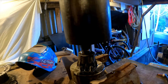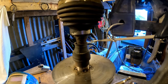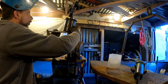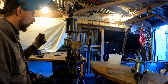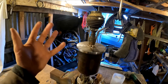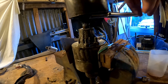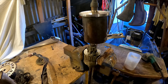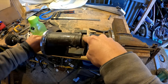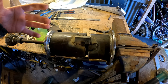I've got my DTI set up here. I've got to play the game of tacking each side to try and keep this drive shaft square - it's still a fair bit out, I'll keep working at it. I've been strategically welding this to shift the position of the shaft as it pulls the weld tips over - some of you know that, some won't. I've actually got it going pretty sweet. It's not the hugest weld in the world but this weld will only be engaged when it's going in reverse - the outer casing will take all the load for forward. So this dog system is welded on there, something will jam up on those bolts to stop the centre, and the sleeve will slide over and lock in.